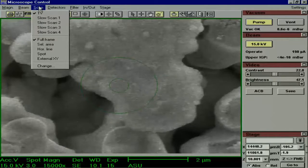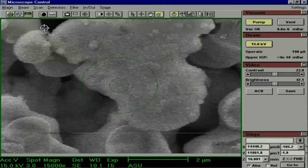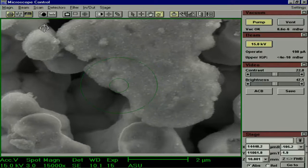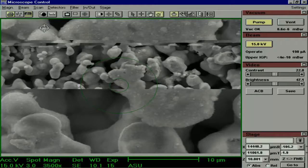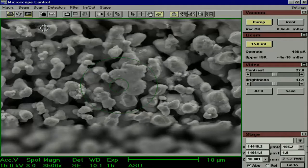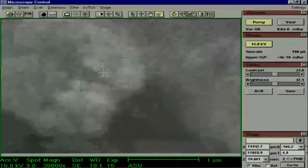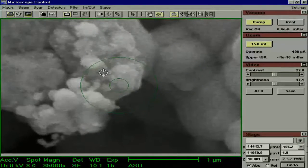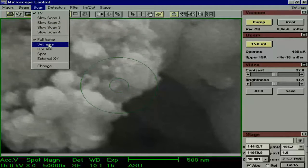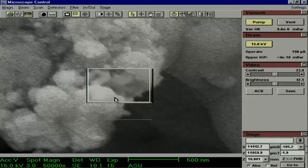The next function is scan, where you can choose from different scan speeds. You can choose a slower scan speed for a clearer image. However, if you try to change the magnification on a slower scan speed, the response time is really slow, which makes all other functions like focusing way more complicated. So for live imaging, we use TV mode. When we go to higher mag imaging, the quality can be so grainy that we can't really focus. For this issue, we can choose Select Area, which scans a small area at a slow scan speed so the response time is still relatively fast — just be aware that the rest of the screen will not be refreshing.